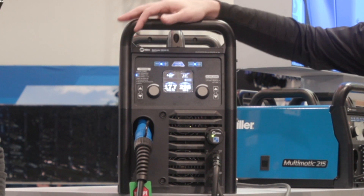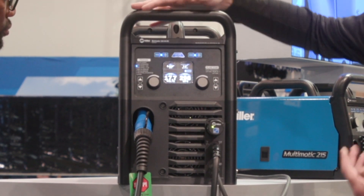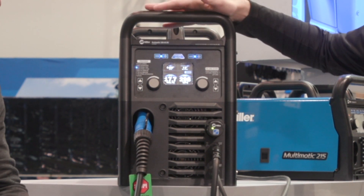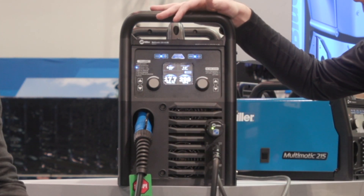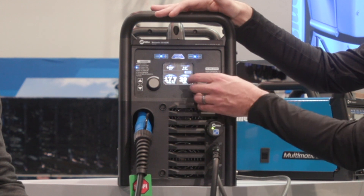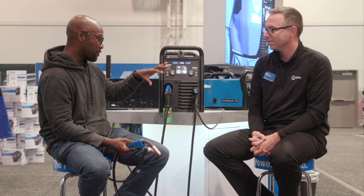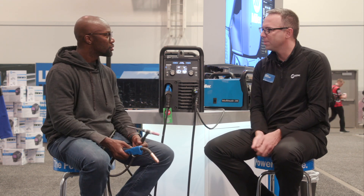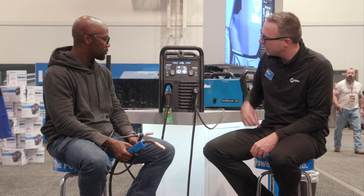Right now we're in MIG Steel C25, and then it will ask what's your wire diameter and what's your material thickness. Today at the SEMA show demo, we're running 030 wire on eighth inch material. We're going to run the volts at 17.7 and our wire feed speed at 280 to 298. Some people might tweak it — so you could still be in Auto but manually fine-tune the other settings. It gives you some freedom and flexibility, but still those recommendations are there to get into your project quickly. You know you're in the recommended setting when those bullseyes come up.